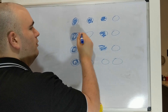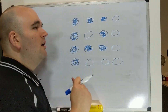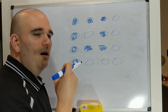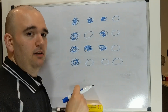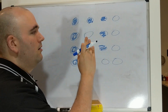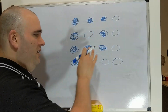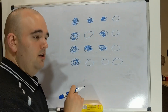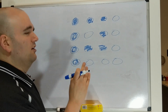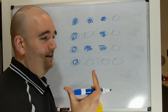This is taking advantage of our eyes being kind of slow, because we can't perceive that rapid switching. So to us it just looks like the display is constantly on. When you get down to it, none of these LEDs are on simultaneously. We're taking advantage of the ability for electronics to go way faster than the human eye or brain can perceive. And if you ever look at a giant display board, it's actually made up basically of this principle — every pixel can be individually controlled.